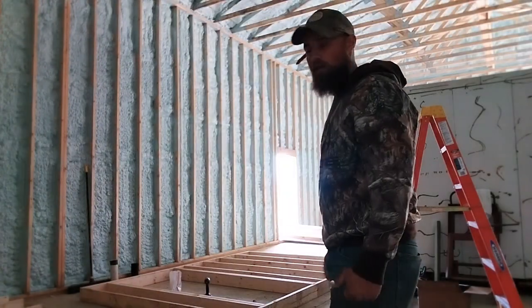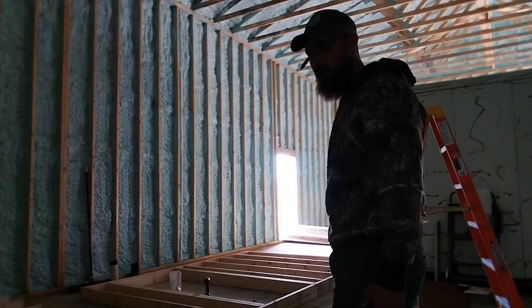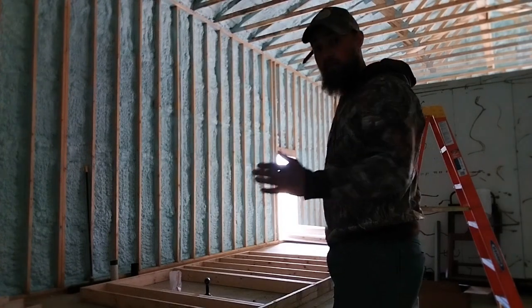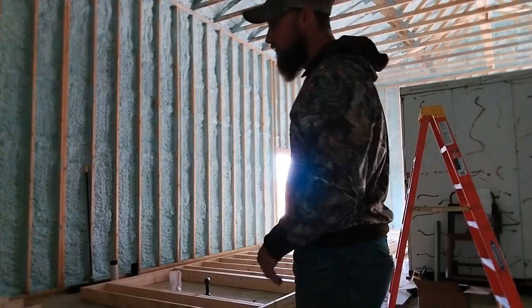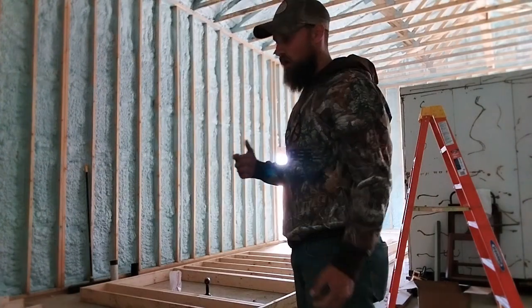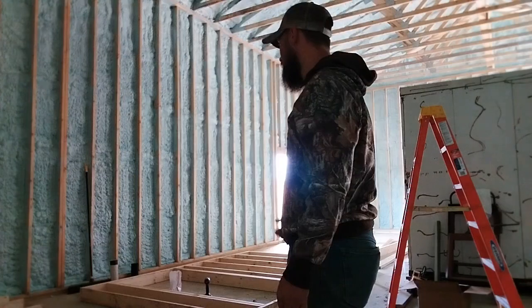It's called crowning. When you're framing up walls or anything, you want the crown on those boards to be all the same way. Usually when you frame, you want your crown up. Flooring, walls, I put the crown up and usually put the crown out on the outside part of the wall.